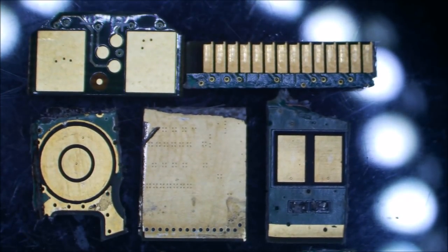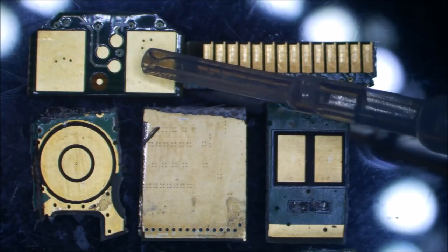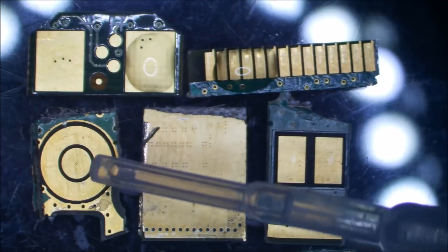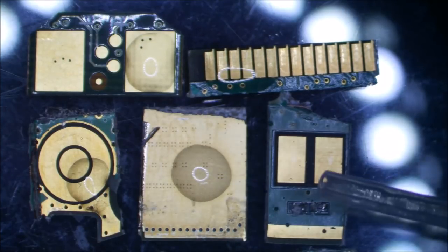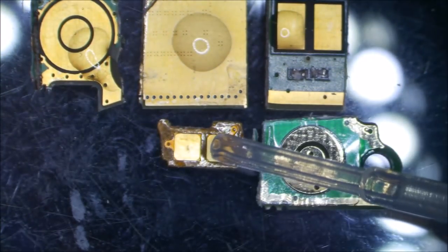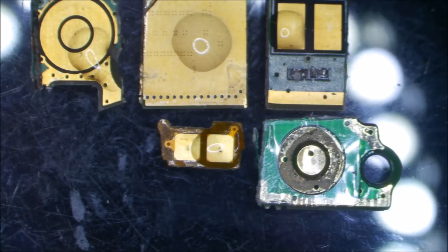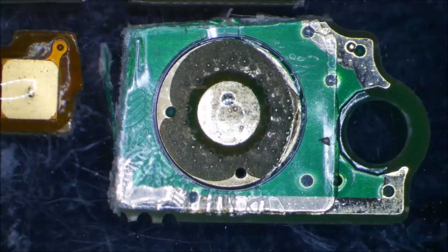As per the last two videos, I have made a solution of 35% concentrated nitric acid - taken some 70% nitric acid and doubled its volume with distilled water. I'll give a drop to each sample: start with the ENIG sample, put some on the hard gold sample, and then go for each of the phone board samples in turn. That bottom right sample is already showing a very vigorous reaction, so whatever they've got in there with the gold to make it harder is very reactive.